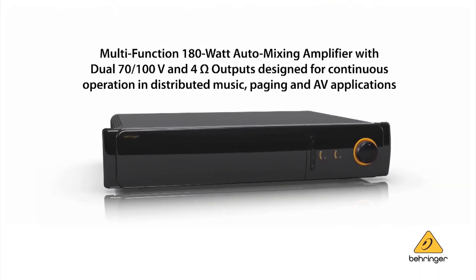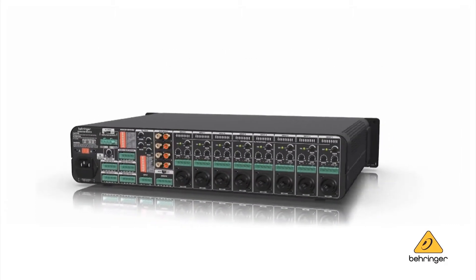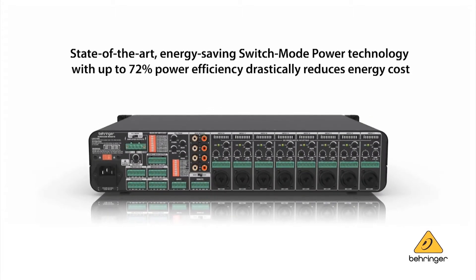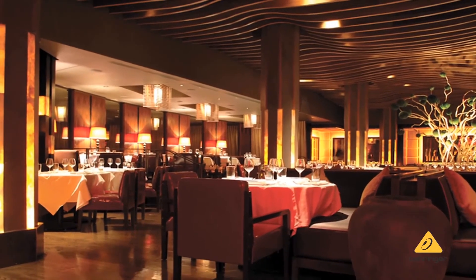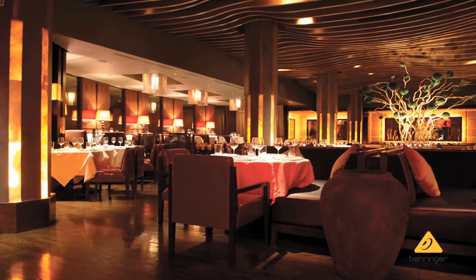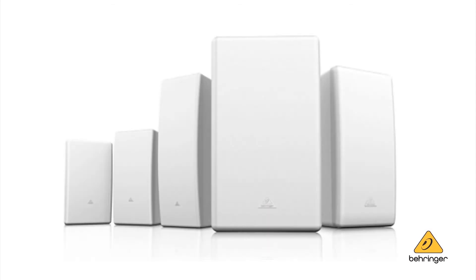Dual drive amplification technology is in fact two distinct separate amplifier channels. The intent is that you would use the high impedance output — the 70 or 100 volt output — to drive distributed speakers, and you could use the low impedance output to directly drive a passive subwoofer, a series of passive subwoofers, or even a high performance pair of speakers all the way down to a 4 ohm load. This gives you an opportunity to deliver higher performance sound in certain parts of the venue and the utility of distributed speakers in the rest of the facility. Eurocom offers a wide range of speakers — from ceiling speakers, installation speakers, wall mounting, and small two-way speakers in both low impedance and 70 volt format — that pair perfectly with the MA6000.